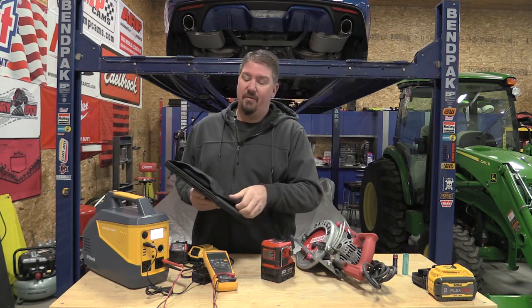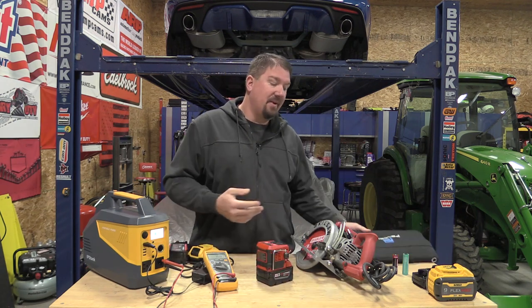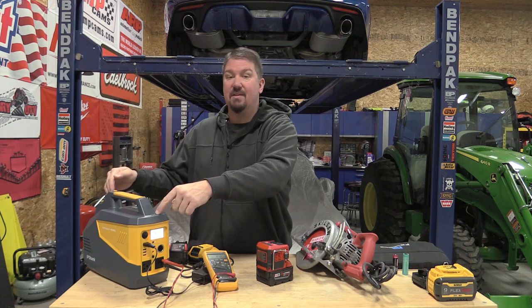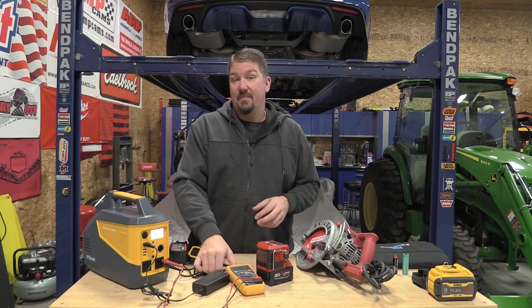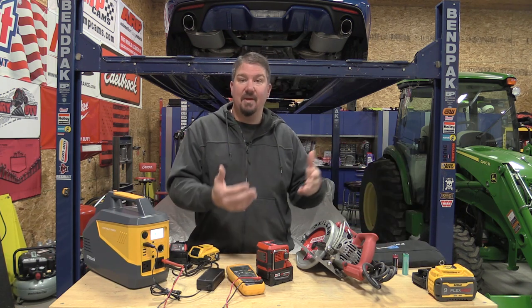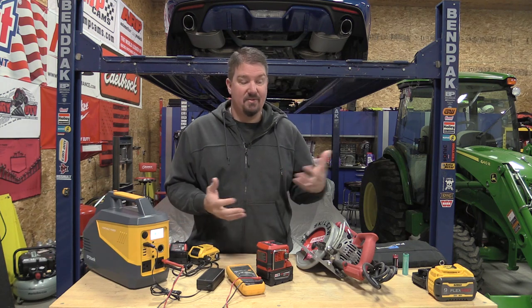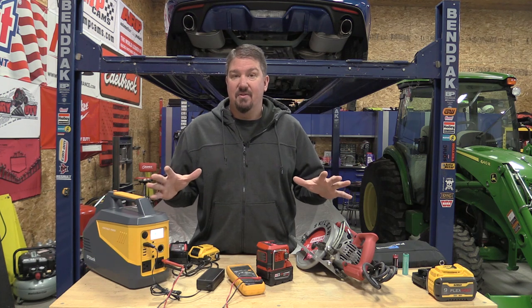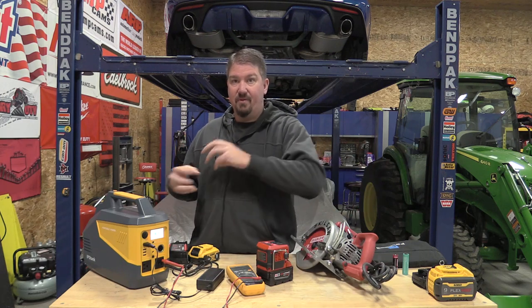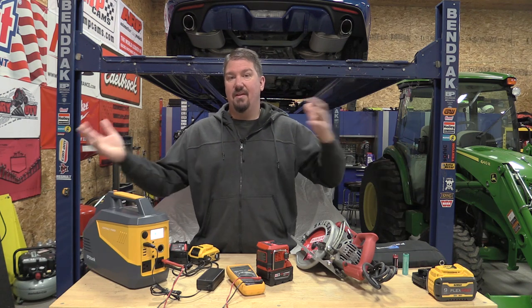Then there are solar panels — why can't we just use a solar panel to charge a unit and charge the battery? Solar is a whole other topic, but as an overview: this unit takes 4 to 7 hours to charge via AC, and 10-plus hours on a bright sunny day using solar, depending on how many panels you combine to create enough volts and watts. There are solar setups on RVs that run two air conditioning units simultaneously with no issue — the panels charge the batteries, the batteries feed the inverter, and the inverter powers the ACs.